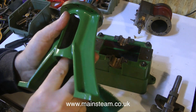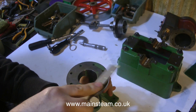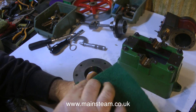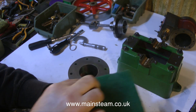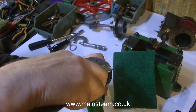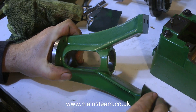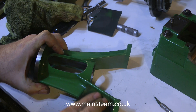The current color is mammoth green. There's nothing wrong with mammoth green on a mammoth steam engine, but a Stuart 5A masquerading as a mammoth is just unacceptable. What is the correct color? Really, I'm not sure — olive drab, Brunswick green, British Racing green? You can buy paint from Stuart Models called Stuart Models Green, but that's changed over the years. From working on a lot of these engines, the most popular choice was Humbrol green gloss number 3, so that's what I'll use.